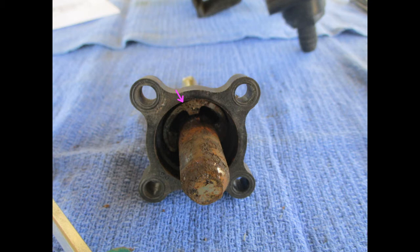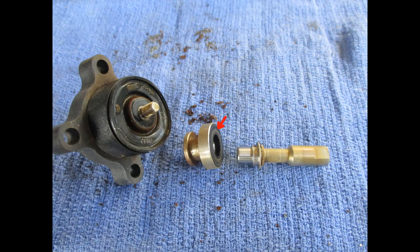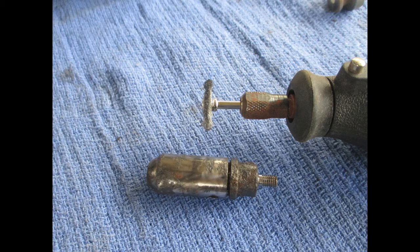Notice the armature is held in place by a retaining clip. The armature is removed by unscrewing it from the stem. This shows all the parts. Notice the washer and spring for the armature — the arrow points towards the second diaphragm and the joint of the stem and the armature. This shows the stem unscrewed from the armature. There is a replacement in the kit for the washer shown.